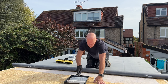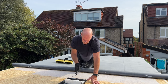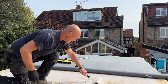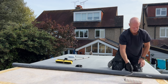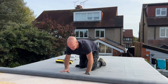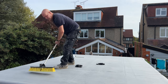I'm not going right to the edge with this — you'll see why soon, it will become apparent in a minute. So once the adhesive's down you're ready to roll it. Just take your time with this bit and make sure it goes down nice and evenly — you don't want any creases or kinks in it. Just get it nice and flat and let it do its own thing as you're rolling it. Then it's time to broom out any air bubbles that get trapped under it.